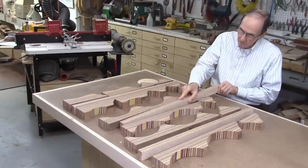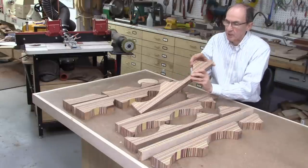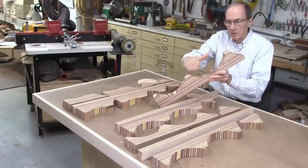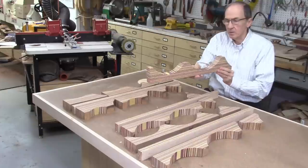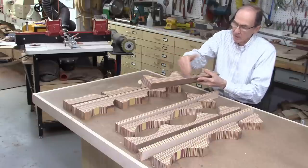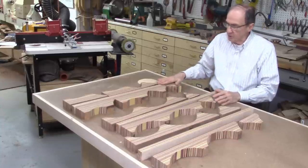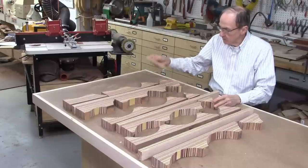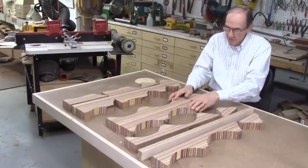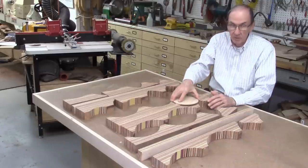I have my three laminate boards all glued, cleaned up, and ready to glue into my pieces saved from the large dizzy bowl project. I made one more change here: these pieces originally had points coming out where I cut my complete circles out, and I cut those off flat. I ran this lengthwise through my table saw to get those flat, because that gives me a flat area to put my clamps on — I can put a C-clamp or a bar clamp across that for good clamping pressure. I have three of these all set up and should be able to get at least a dozen six-inch discs out of each. The next step is to glue these together using epoxy, clamp them, and let them dry overnight, and then we're ready to start cleaning them up and cutting our discs out.